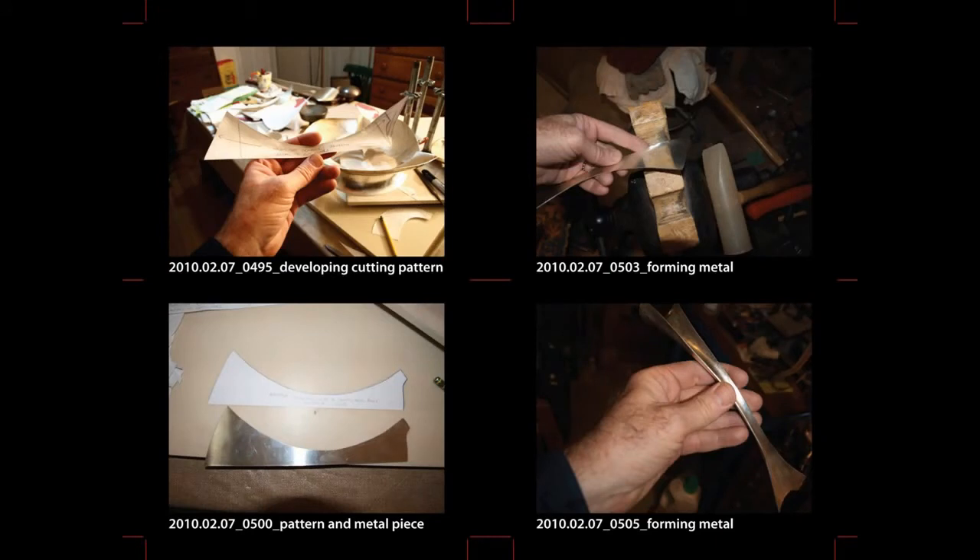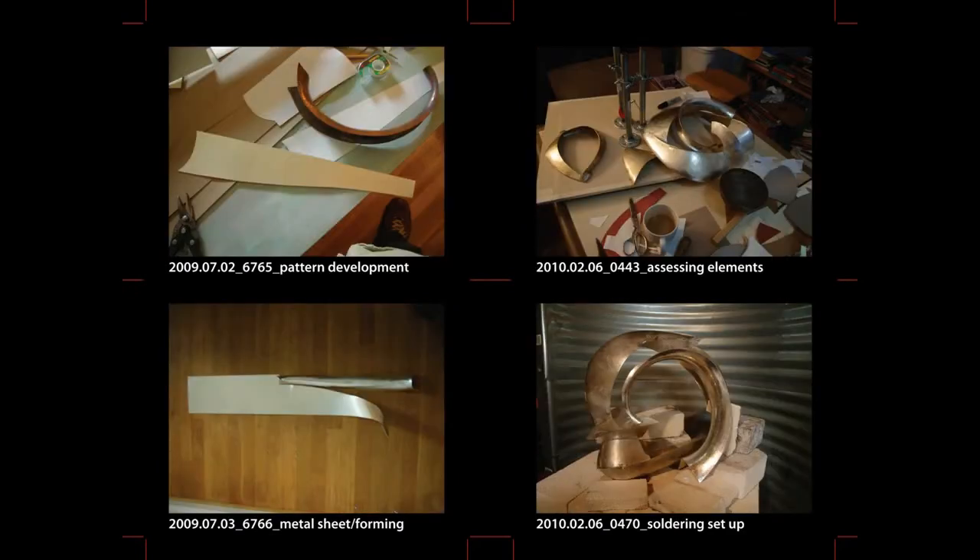These are some steps in making a vessel such as that. These vessels are made out of maybe about a hundred pieces of separate sheets of metal that are hand-formed. In the upper corner right here you can see I've got a template, and here's where I've cut the metal and I'm actually forming it in a wooden form. This is another template sheet — a lot of template making, a lot of paper templates here.